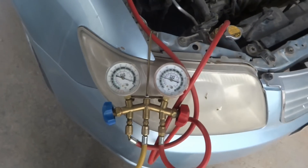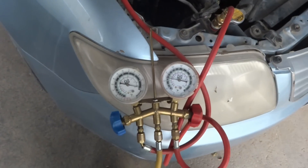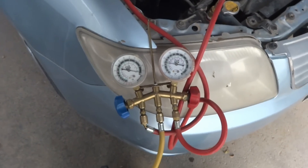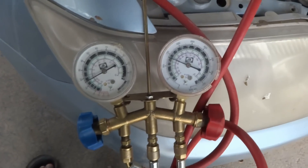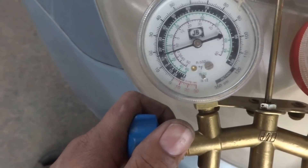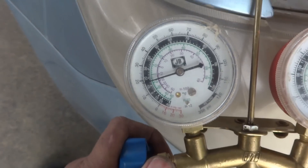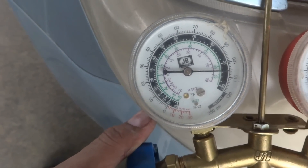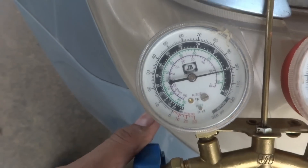Start the car please. Now we are going to start the car and fill the air conditioner with freon while the air conditioner is switched on. Start it at a low speed and switch on the air conditioner. You can see the pressure dropped when the air conditioner was switched on. We need to fill more because the low side is showing less than 20 psi — it should come to somewhere 42 to 45 psi to give cooling. I will fill in the freon not all at once but with successive intervals.